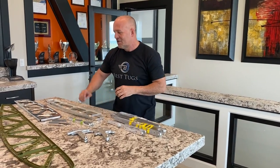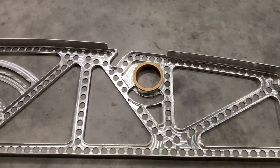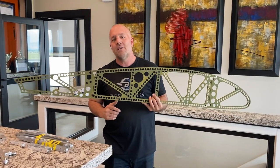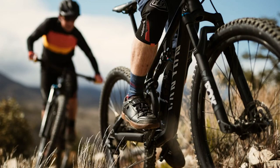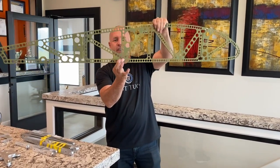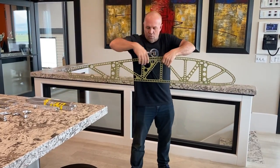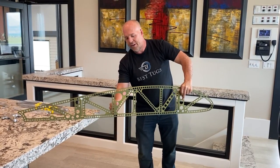I'm really excited about it. So here is Scrappy. It is mirroring a truss web design. Now, I wouldn't have to do all of the ribs internal or truss web design, but there's several points along my entire wing that I'm adding embeds for heavy point loading options to hang really big, heavy things off the wing if I want to. Some of those are things like mountain bikes, one wheels, all kinds of attachment brackets. So I wanted to make sure that if I point loaded here, or here, or here, I don't rip the bottom of a horizontal member out of my planes. If you look close, you can see one spar there, one spar there. Those are the loads carrying between the spars, and now I have strong point loads at these key locations.